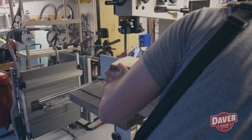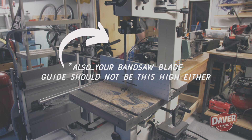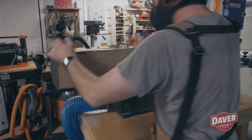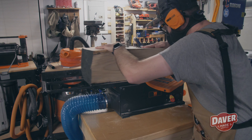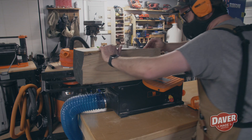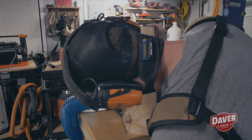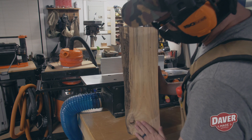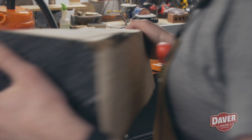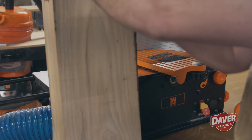That's again why a jig is probably the better route to go. When cutting this log up, there's a lot of tension in there, and these logs are also super wet — there is a lot of moisture trapped within them. You'll be able to notice the wetter layers as I use my jointer. Those two little spots right there — that is moisture, and you could really feel how wet this log was. What I'm trying to achieve is a dead flat side, a cant, to run against the fence on the bandsaw so I can get straighter pieces. I made a mistake and got a little impatient — I should have done this on two sides, not just one. That would probably give me better boards in the end, but this was my first time and I was really excited to see what I could get out of this.